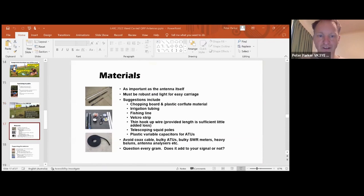As far as materials for antennas, that's pretty important if you're operating portable because you want the antenna to be super light. It's okay to use thin wire, provided you don't have loading coils or traps that would weigh it down. Some materials you can find in your kitchen - like kitchen chopping boards - are a good low-loss material for antenna insulators. You can cut them up with a hacksaw. I tend to avoid coax cable as it can be bulky and heavy. Also avoid bulky antenna couplers, and bulky VSWR meters, especially if your transceiver has an SWR indicator in it - just get it to the lowest reading, you don't need accurate VSWR. Only take the minimum. Question every ounce - if it doesn't add to your signal, leave it at home.